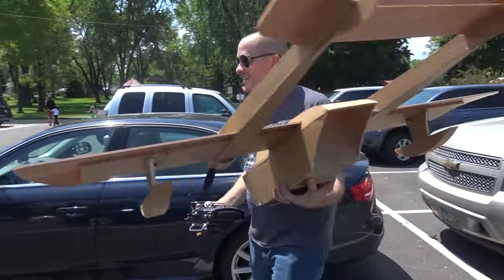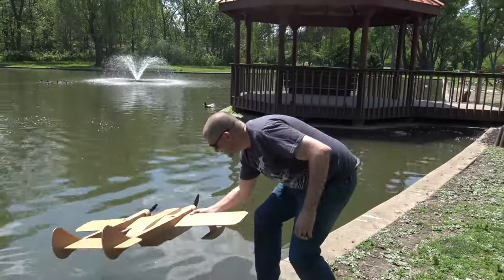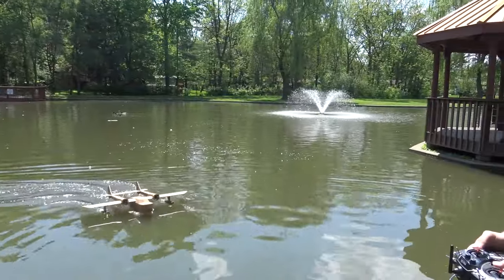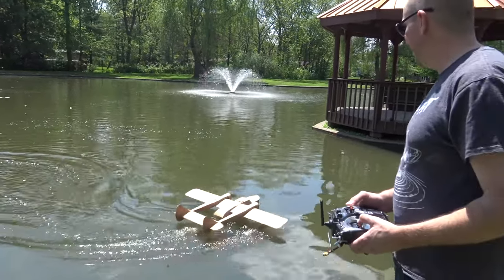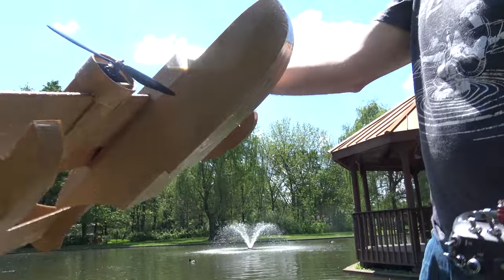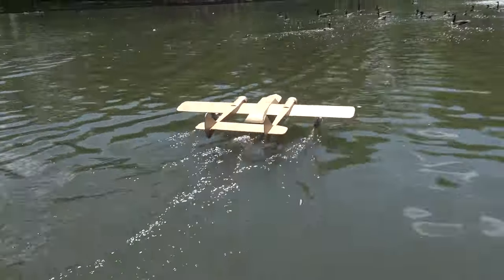The wing pontoons on the outer side, we kept the shape originally, and Peter immediately saw that and said, you know what, you're going to have an issue, it's going to create a low pressure pocket. I had the same issue with my Otter, and he was absolutely right. Steph and I took that out to a small little lake and tried to do a little bit of testing, and it immediately sucked the pontoons underwater. You're fine as long as you're going straight, but the second you turned, the pontoon would drop into the water.